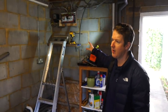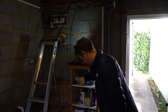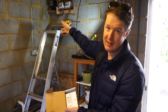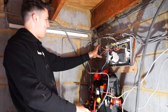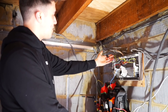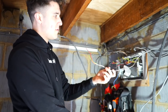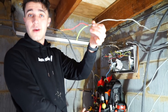Cory's going to smash this consumer unit out. We've got a sub-meter there which is a hideous meter, and Cory's going to change that to this nice new one. Because it's an annex that could be rented out, it's just a check meter so they can monitor how much electricity the annex is using. It's a bit of a mess - there's a meter and a time clock, cables coming into the board that are linked out, but the neutrals go into the neutral bar while the lives don't do anything. I've never actually come across that cable before, but I'm only young so I've got lots of time to come across cables like this.